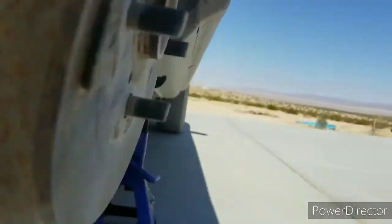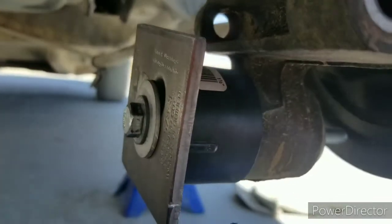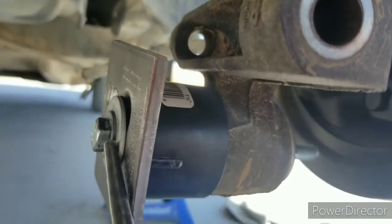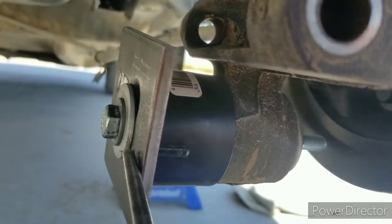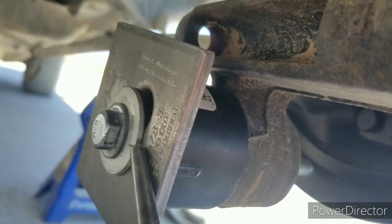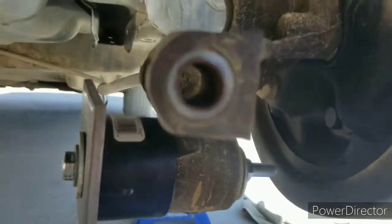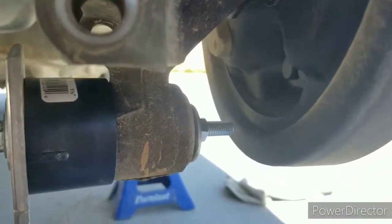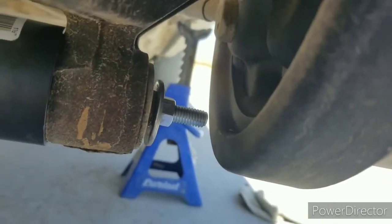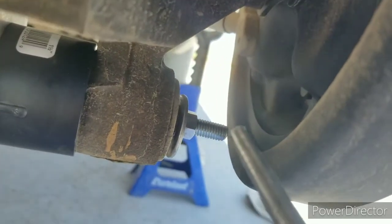Here's your setup. On this side you have the bolt head, then a washer to make sure it clears the hole in the slotted square washer so it bites the edge and can push on it. Then you have your square washer, then your inch and a half coupler, then the hub with the bushing, then just any old washer, and the nut on the other end. That's it.